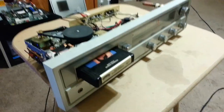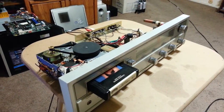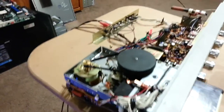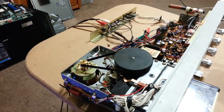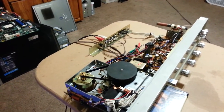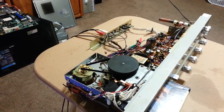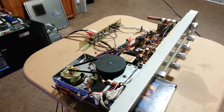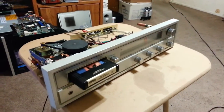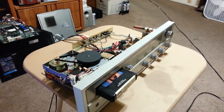Overall, it was a fun little project, and because this thing kind of jams a little bit every once in a while, I'll probably still clean out that motor one more time to see if that's the issue, and if not, I'll put a little toggle switch up here just to give it a little push if it needs it while the case is still on it. So there you go — a 40-year-old 8-track player restored to full working order. I'm pretty happy with how it came out.